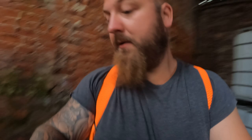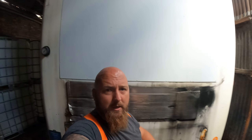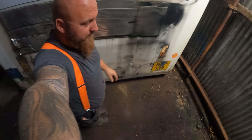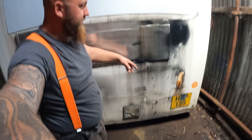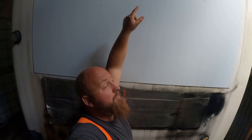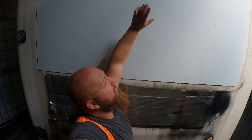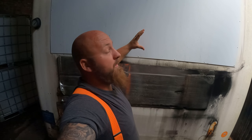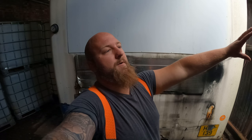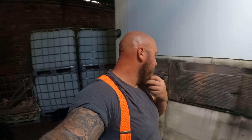So we're at the back of the container here. I'm thinking of mounting the blower not at floor level - it's about 10 inches off the floor - and not halfway up, but sort of three-quarters of the way up. The reason is so I can get the hot air up the top, and then the cooler, humid air can drop down and get sucked out by this big 24-inch fan that we're going to install.